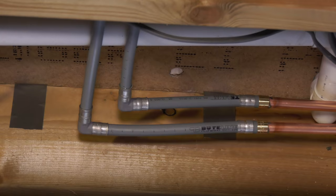All done — we've got our pipework in, we've put a little bit of Buteline on there. We've got two radiators on there. Schematically from above: we found our flow and return pipes for the heating system, teed into them to go up to the towel radiator, then carried those two tails around to the little radiator on the back wall. We fed those two radiators effectively in one set of 16mm pipe, teed off earlier in 22mm. As a rule of thumb, the maximum number of radiators you want on a 15 or 16mm pipe system is three, otherwise you'll start getting balancing problems.